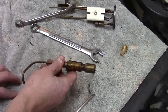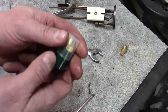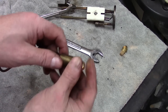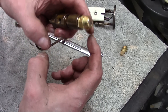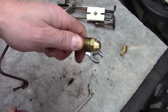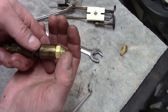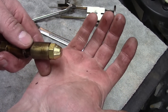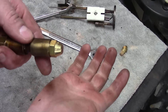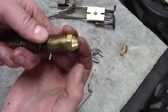I've even seen, after having a cleaning done on this Baxi boiler with a Riello burner, that the person used the wrong nozzle — it's not really a common nozzle for it. Nozzles generate different spray patterns: they're cone-shaped, and some of the cones are hollow while some are more solid. It's really important to use the correct nozzle and have your burner tuned to the nozzle it's supposed to be using, because that makes it the most efficient. If your pump pressure is reduced because of a clogged filter or screen, it's kind of like a Windex bottle where you don't give it full pressure — it's not going to come out with a full mist. And if the nozzle is clogged or partially clogged, you're not going to get the same spray pattern.